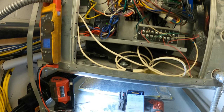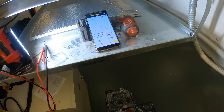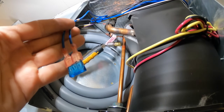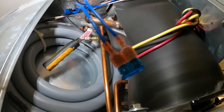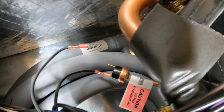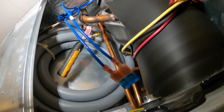It's calling for cooling, fan started. Let's give it a few minutes and see if the compressor starts. I turned the power off — but look at this. This thing has bypassed something. Wires 27 and 32 with a car fuse. And look up here — there's only one wire on that control. Unless this is one of them and they bypassed everything.